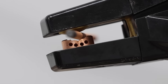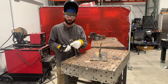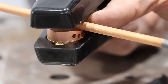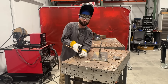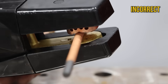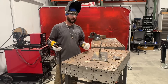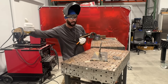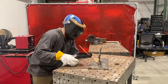I think there's only really one good way to hold this arc gouger. You've got to make sure there are holes on it — it looks a lot like a stick stinger, just really bulky because of the compressed air running through it. It's very important that those holes are oriented on the bottom side of your electrode, so as you go, the air is blowing from the bottom and throwing everything away. If it's coming on the top, you're going to push all your metal back in and just make soup. We're always going to push it — lean back at a good angle so that air blows it up and away.